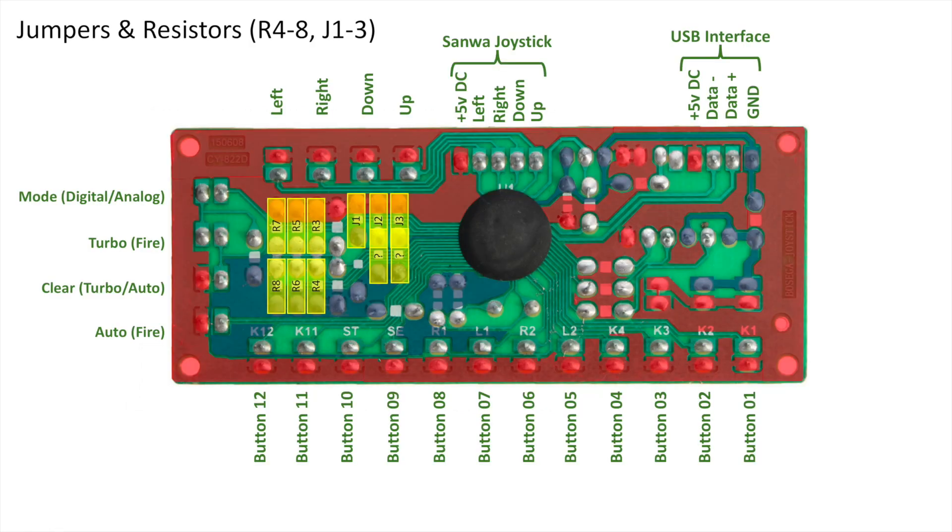The last area I haven't been able to figure out involves jumpers J1, J2, and J3 along with a bank of resistors. I believe there may have been previous versions of this board that were PS2 rather than USB, and this may have been for that. None of these resistors or jumpers are populated. They do connect into the IC - half the resistors connect to the five-volt rail, half are grounded, and the jumpers bridge them together. It might be some kind of voltage regulation within the IC, but it's definitely not being used anymore. If anybody knows, please comment below.